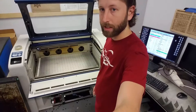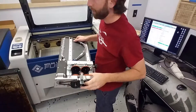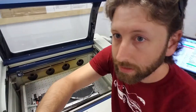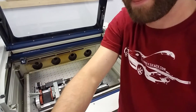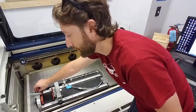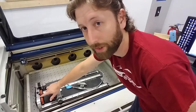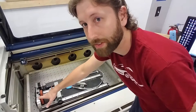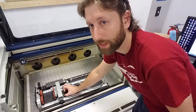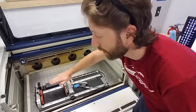The rotary tool is down here at the bottom. Go ahead and set it onto the bed. This piece right here I only use if I'm going to use really thin glasses — like wine glasses — where the end is so light it won't actually turn from the drive wheel. These wheels here are the drive side that actually turns the glass, and this side is just idler wheels that hold the other side up. You can push these in to move it back and forth, and turn this knob to raise and lower the idle wheels so you have a flat surface on top.